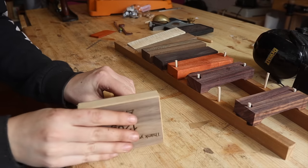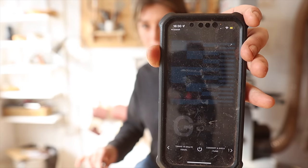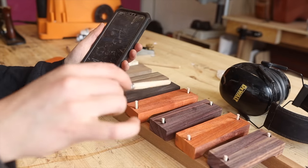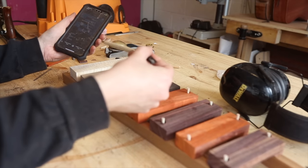At this stage I noticed all of them needed a little bit of a fine tune, so I went in with the hand sanding block. Just like with voicing a guitar, I realised that the smallest micro-adjustment would make a big difference on the pitch. I also drew in the help of my strobe tuner, which I also use when voicing, to track the progress of the resonant frequencies. This is a highly accurate tuner, and I did notice that it could pitch the denser woods within half a second of me striking the key, whereas the walnut and the sycamore — our lower density woods — were unable to produce a clean enough note for the strobe tuner to lock onto. Presumably this is because their articulation isn't as good, and the more mellow, rounded sound I was expecting from them was certainly being demonstrated as I struck the keys.